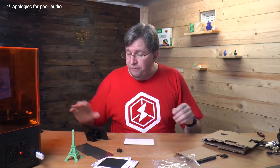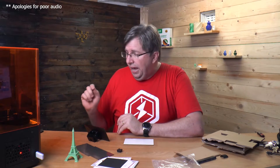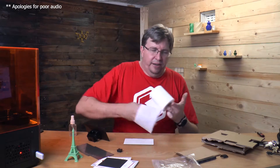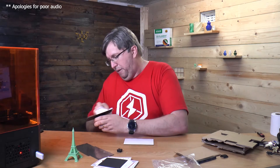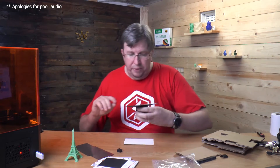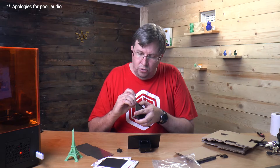What's suggested is that you first put your magnet plate down, put the flex plate on top of it, and make sure everything lines up and is the right size. I've thoroughly cleaned off the build plate, degreased it, taken off all the resin, thoroughly washed it, and then used a little isopropyl alcohol for one last wipe — not the best thing to do in an enclosed space but I had touched it quite a bit. You don't want fingerprints or grease on there because that will cause the glue to lose adhesion.